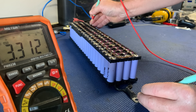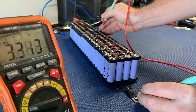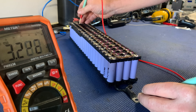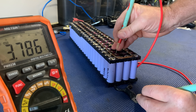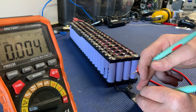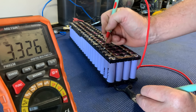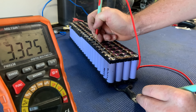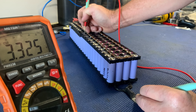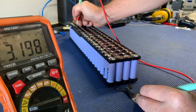Now, if you had an accurate enough multimeter, you could tell the voltage drop without snipping your fuse wires or your link wires. So 3.3, 3.3, 3.3 — it's odd, that one's 3.7. So it stands to reason the fuse on the other side of that cell has gone bad — that's the negative end. I snipped a cable on this, and I checked it like four times in four days, and I didn't have a heater anymore, yet I've got no zero-volt cells. That is odd. Unless it was a cold joint or something, and moving the wire around a bit gave it a better connection and didn't get so hot with high resistance.